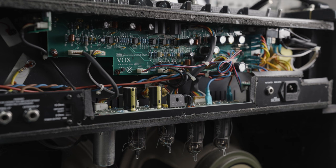They run them well and truly beyond what they should be run at. The original ones back in the 60s were using old Mullard tubes and similar things that could take the abuse. Modern production tubes can't quite keep up. I don't know why they insist on designing amps running them at plate dissipations at like 120% of what they're designed for, and plate voltages sometimes an extra 40% over what they're rated for.